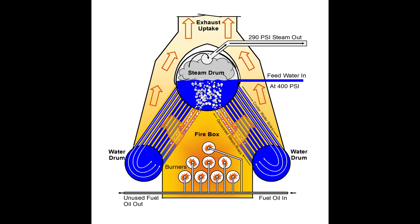It is called an express boiler because of its ability to quickly produce large amounts of steam. This is because the large number of small tubes creates a tremendous amount of tube wall surface area. As surface area increases, more water in the tubes is exposed to the heat, meaning that it will heat faster. In this design, the surface area of the tubes created a total steam-generating surface of more than 6,000 square feet.